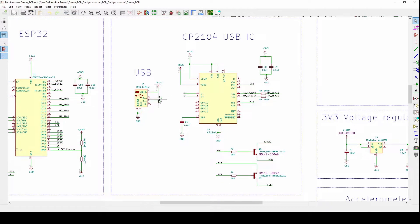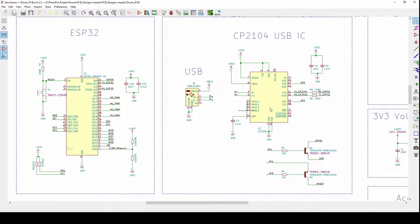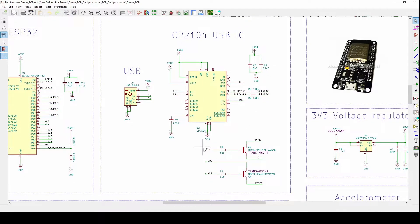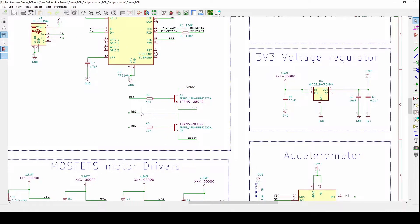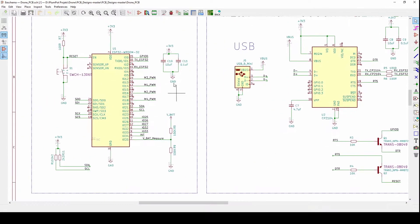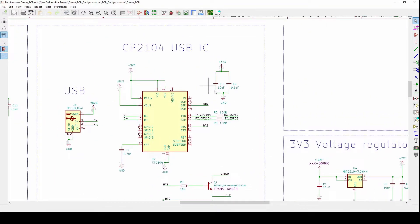The CP2104 is the USB-to-serial converter — it's a very stable IC and also just a preference since I've used it in previous projects. Basically it takes your USB connection and allows you to program your ESP32 via TX and RX. You guys have seen many times that when you buy an ESP32 dev board you get two buttons — enable and boot — that you push in a certain way to upload a program. But you can add transistors to allow automatic upload. This IC has RTS and DTR, which toggle in a certain way to put the ESP32 into programming/boot mode, so you don't have to manually pull the GPIO reset pin.